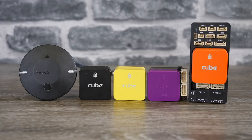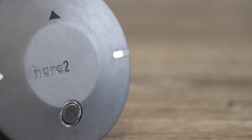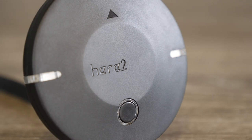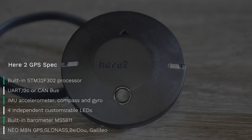Just like the original carrier board it has all the same connectors, it just has the ADSB-In receiver by UAVionics built in ready to go. Alongside all of these cubes there is also a new Here 2 GPS. It has been out for a little bit of time and has some big benefits over the original Here 1. Whilst it's the same shape and size, it has been pretty much completely overhauled with all-new sensors and LEDs, and is now compatible with UAV CAN. The new Here 2 has a built-in F3 processor, capable of running code on board, with UART, I2C, and UAV CAN.